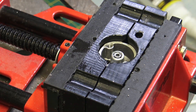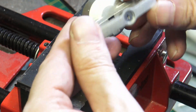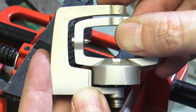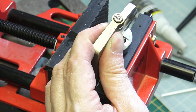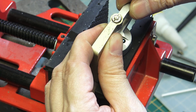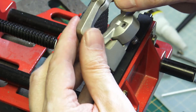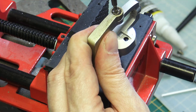That feels good. Let's put that into an L-shaped bracket. That looks good — it looks like it's flush and straight, and we have a good equal amount of space around the top and the bottom. Let's put the bearing lock back in the top. Now we need to tweak this — we want to get it so that it spins freely, but we don't have any play to the sides. Okay, so there's no left or right movement, but it's not spinning quite as freely as I would like, so I'm just going to loosen it off a little bit.